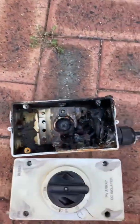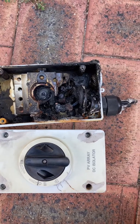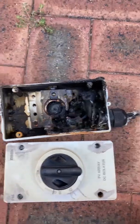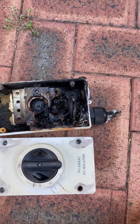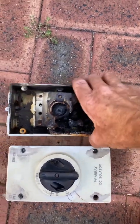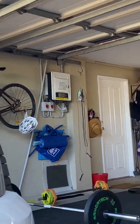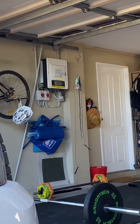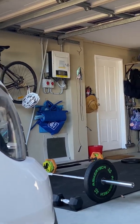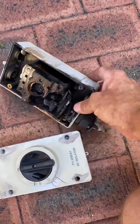It's made quite a mess — quite a barbecue. Luckily it didn't start a fire. This is the source of many a rooftop fire in Australia, because here we have to use these isolators on the roof, which many people don't agree with — they are a point of weakness. If this were downstairs, as you can see there are more isolators under the inverter, and if one of those had the same problem it could end up a lot worse — the fire starts down there and can potentially end up in the roof and take the whole house. Good result with this one at least — it didn't go too far, didn't have a full-blown fire.